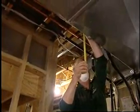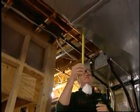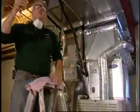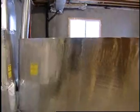You're going to get a measurement. Cesar, this duct is 8 inches deep. I'd like you to go take that board off the side and cut that for me about 8.5 inches. I'd like it to hang down about 1/2 inch.